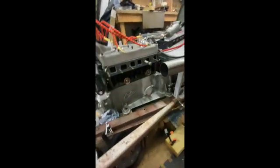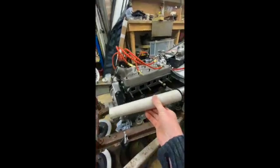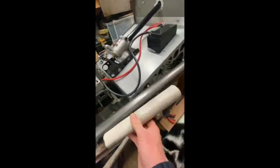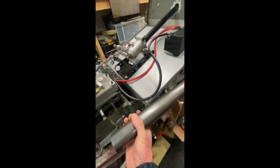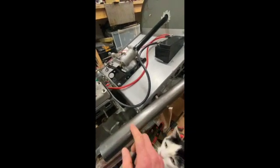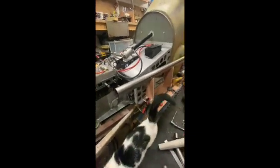The first step is to try and make something which takes a one and three-eighths diameter down to two inch, so I need some kind of cone. I've made this cone up in cardboard and it's going to stick on there like that. The way I'm going to make it is by cutting a length of this tube just over 12 inches, cutting out a V-shape in the tube, and then pinching it using Jubilee clips — pinching it closed — and then welding up the seam, and then finally trying to beat it so it's nice and round. That's the plan.